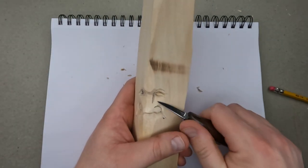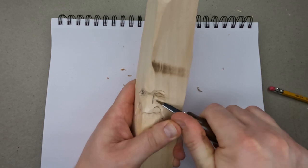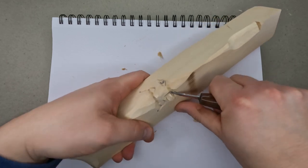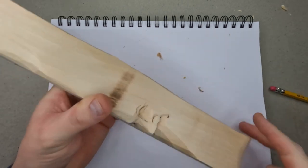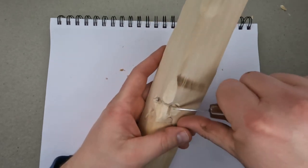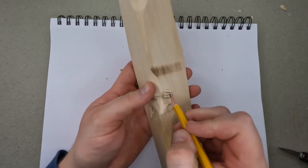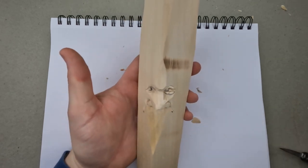What you do is just come in from the bottom up. Stop at the bottom of the eyelid. Using the tip of your knife, kind of a rolling cut — come back in, score that, cut it right out. Let's go back in, pre-cut it. There we go — it gives you the bridge of your nose, or the start of the bridge of your nose. Just define that a little bit more. Shape down. The bottom of your eyelid can determine however thick or wide you want — same thing, same principle.